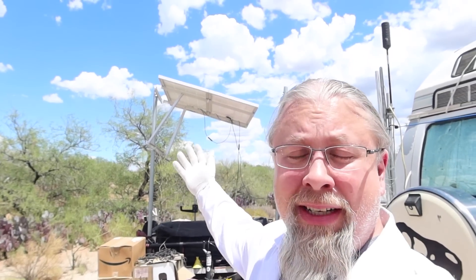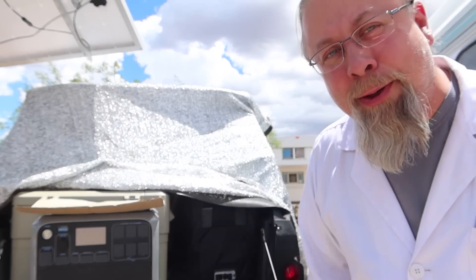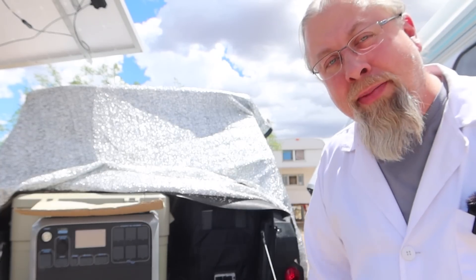So there you have it: nearly 1,000 watts of solar going into the AC200 and getting about 600 out. It rained for the last two straight weeks — this is the first break in the sun we got, and a big cloud is about ready to move in. This is the best I can do before the end of the campaign. By over-paneling, you're guaranteed to get at least 500 or 600 watts. Even with overcast yesterday I was getting 400 watts with the sun not even shining through the clouds. We're hitting just about 600 watts, but not quite that 700-watt cap on the Bluetti yet.